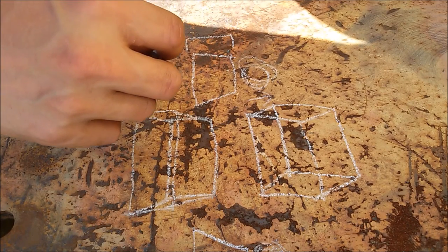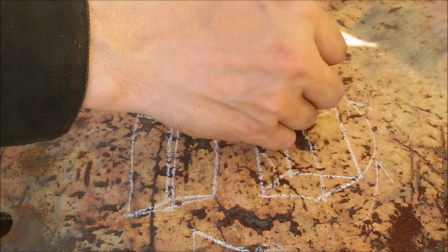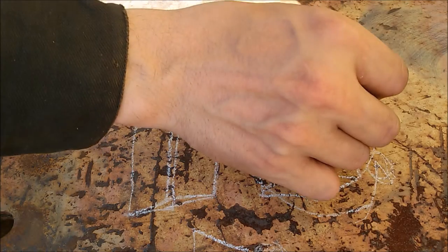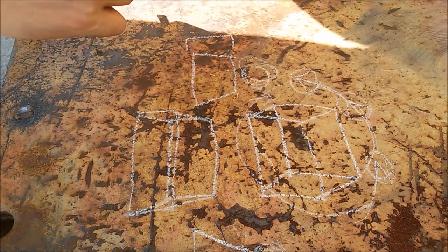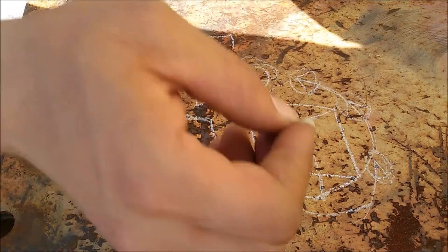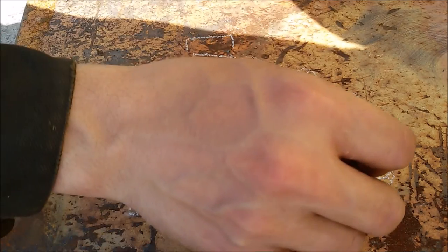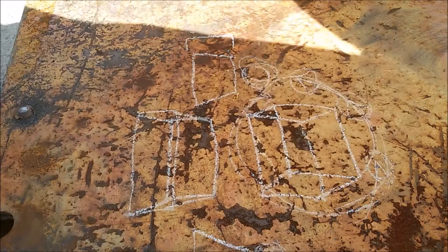But you don't want to be stopping and starting, going over one process and then this process and then this process if you can help it, when you're going to have to go all the way around again. You want to be able to go here, do all the things that you need to do here, go here, do all the things that you need to do here. That being said, a lot of times I will put in a scout project, as in do the whole thing once first. If I have 8 to do, I'll take 7, put those 7 aside, do the one first, make sure everything's correct, make sure it's all within the tolerances that I need, and then go back through and finish process all of the rest all at once.